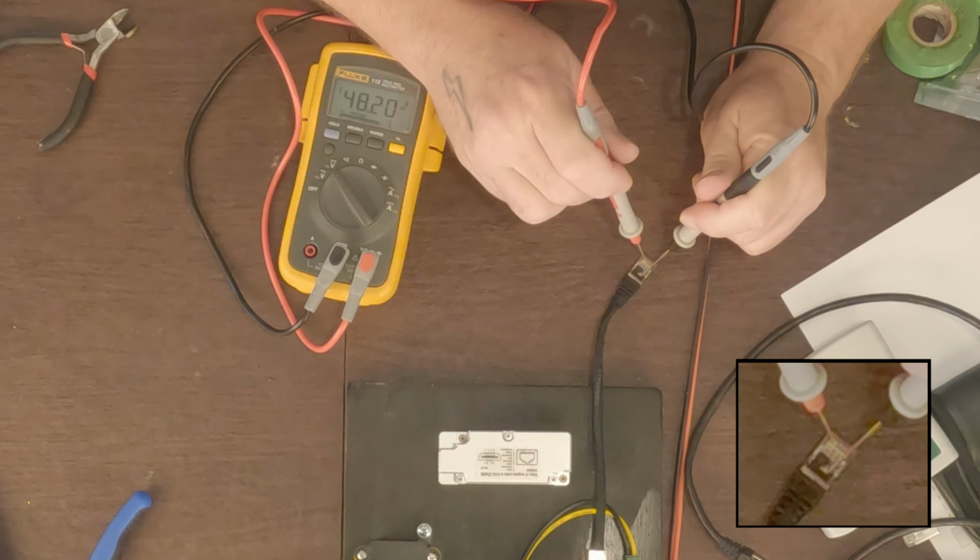And what I surmised was probably happening is there was too much voltage drop, so that by the time it got out to the Dishy, the voltage that was 48 volts here was substantially lower. Now, unfortunately, that proprietary connector, I'm not able to measure the voltage on that. I'm not equipped to do that. But this was my assumption, and then as I read a little bit more, like for instance, you could join the Starlink Hacks Facebook group or one of the other online resources, there was some indication that others had had a similar problem.